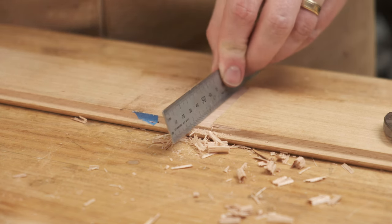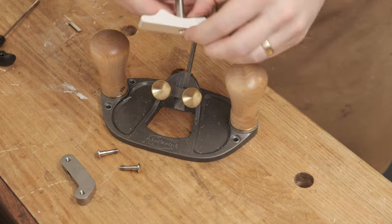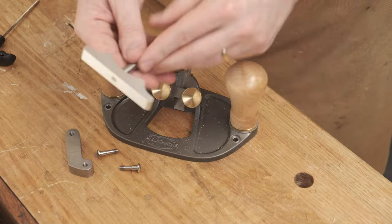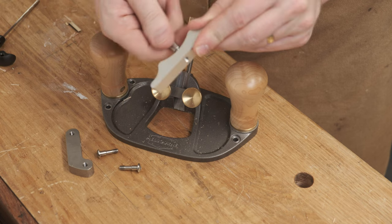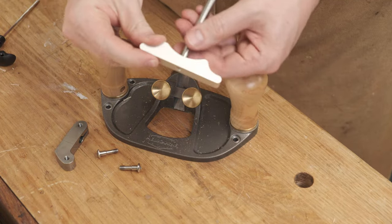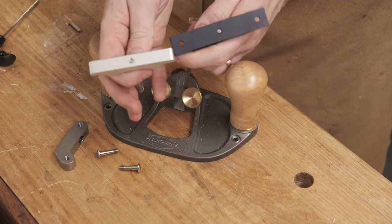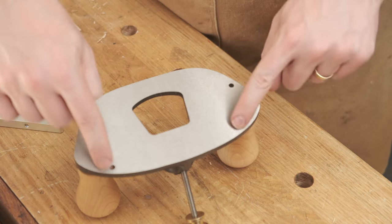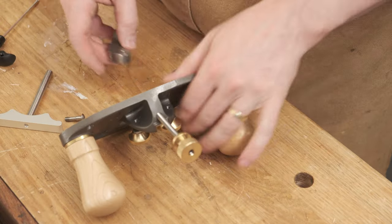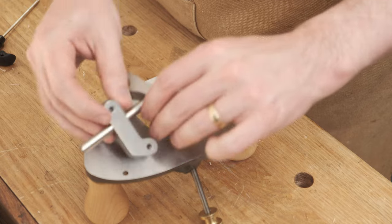It's pudding time - the proof is that it's nice and flat and does what a router plane should do. The last thing that makes a router plane a router plane, at least to me, is the fence - and this comes with a fence standard. We've got the fence piece itself and the bracket that attaches between the router plane and the fence. It's a piece of aluminium threaded on a little steel rod that will get clamped in and gives a reasonable amount of range. To attach the fence there are two holes on either side of either handle - pick a side, two bolts go through and attach to this arm, and the slot provides the clamping action.